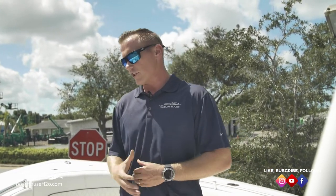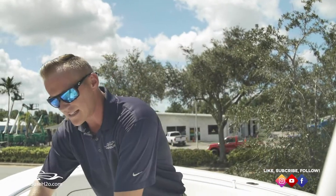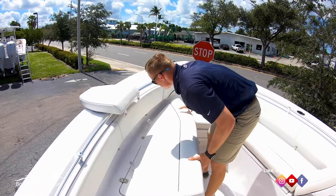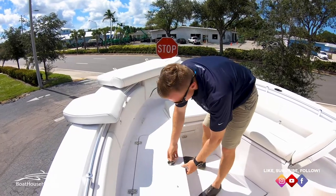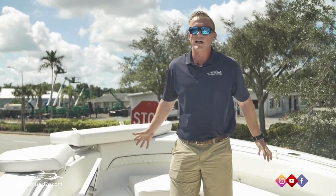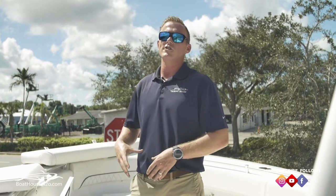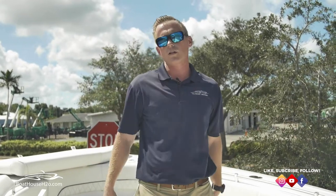As I'm working through a boat, my steps are: I'll do all of my seat cushions first, get them cleaned off with soap and water, then take them off and pull them aside — whether on the dock or on the ground — so you can get to all your gel coat and non-skid surfaces as well. Another nice thing I like to do is once I'm done for the day, open up some of your hatches and let them breathe out. That way if there's any water or moisture inside, especially if you have life vests in there, you don't want mold growing. So while you're finishing up toward the back of the boat, open up these compartments and let them air out.